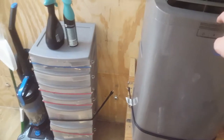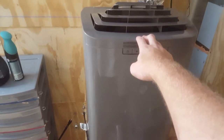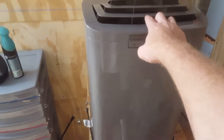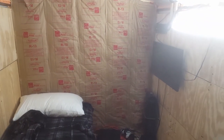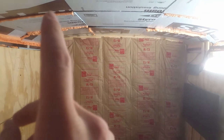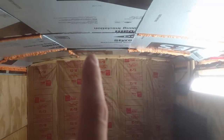My trailer is a 7x16. With the insulation I've got, even being 13,000 BTUs, this air conditioner wouldn't cool the whole trailer efficiently the way it was. That's why I framed that wall back there and used the 2x4 stud insulation. If I could do all this again, I would not use this blue insulation up here because it's not even half the R-value of that R13 — this is like an R5 or R6.